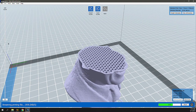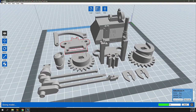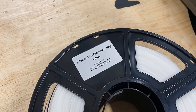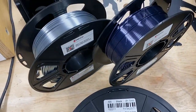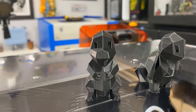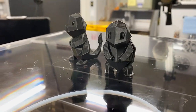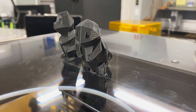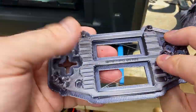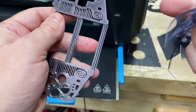To prepare for printing, I sliced a bunch of models ranging from simple to complex to mechanical to test many aspects of the machine's performance, accuracy, and extrusion consistency. While the machine comes with a 1kg spool of white PLA, I used black PLA, black ABS, silver silk, and black silk. Starting with a couple of black PLA low-poly Pokémon models by Floatastic, the models printed well at 0.2mm layer height with 20% infill — clean and nice. Next, I printed one of my Arcader subframes with the same settings: clean layers, tight tolerances, no overextrusion, and the support layers removed pretty easily.